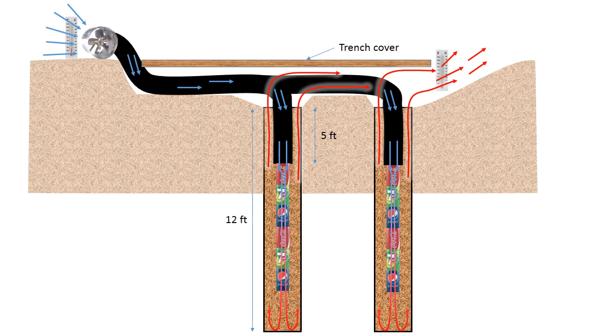I found — if you watched part one — that putting an aluminum or otherwise metal tube in the deepest part of the hole, taped to the drainage pipe, moves air to the very bottom of the hole where the air is closest to the warmest earth. Being aluminum, you get maximum heat transfer between the cold air coming down and the warm air in the earth tube. A good heat exchanger really helps the performance of the earth tubes.